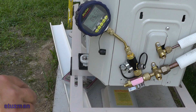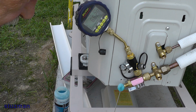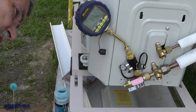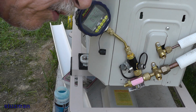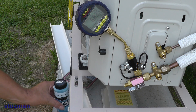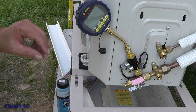As a final check, we need to make sure that the valve core is not leaking. We're going to put a little bit of bubble solution here and cover the end — there we go, that's covered pretty good. We're going to give it about a minute and watch to see if any bubbles form. It's been about a couple of minutes and everything looks fine — I don't see any bubbles.